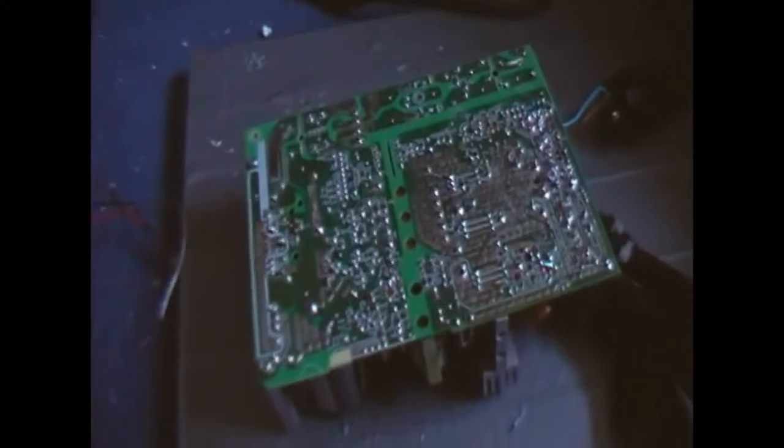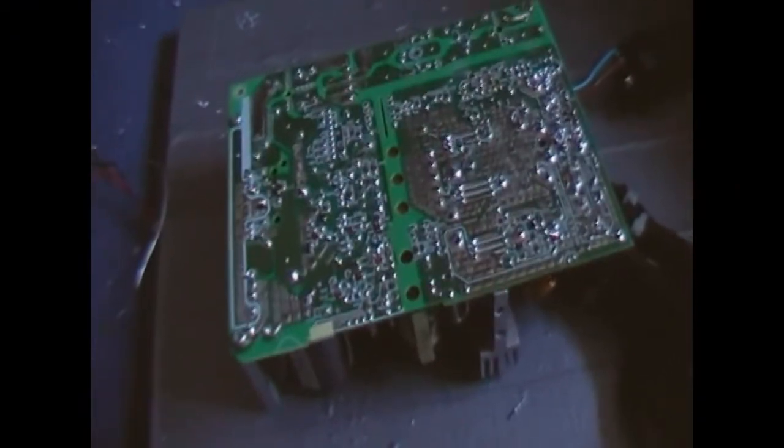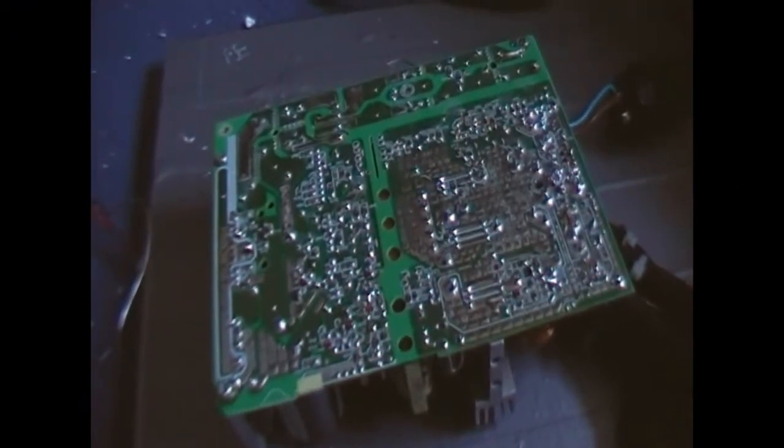What are these? These are KFs. I've seen these fail before. We had only 2 bulging. This one's actually bulging at the bottom. But there were probably more bad ones because every single voltage line had bad ripple current. Anyway, I'm going to get this back in the case. So it's been a repair success so far. Let's not mess it up now.